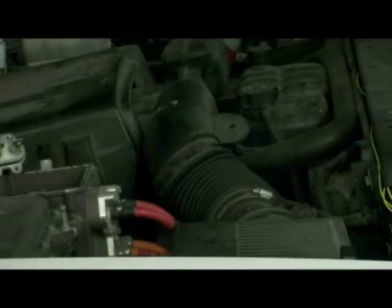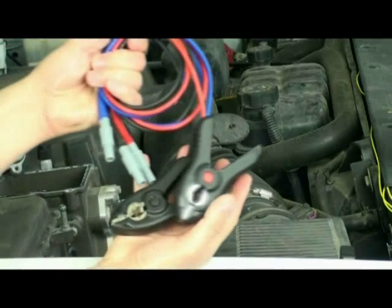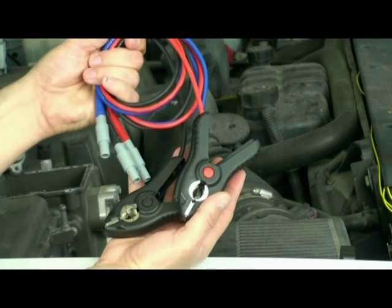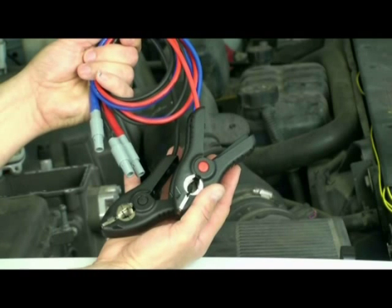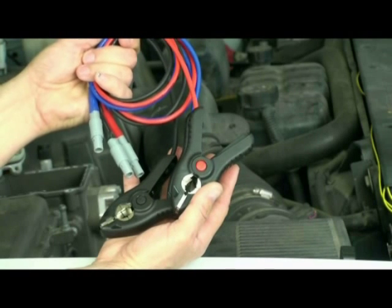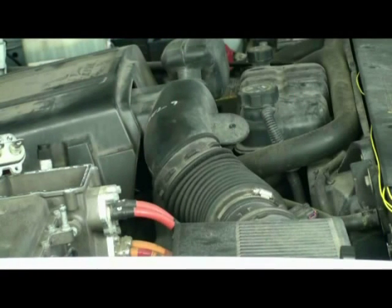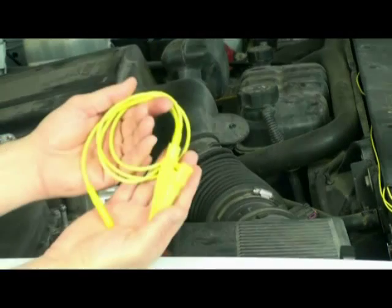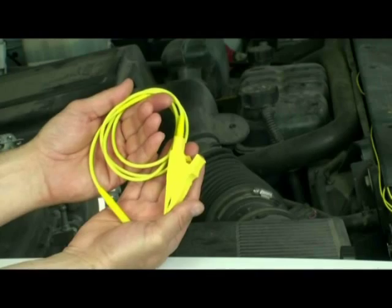As part of the accessory package, there are three leads that will be connected to the rear of your AT33EV instrument. These test leads are color coded blue, black, and red. They will be connected to the three phases of the motor and generator to analyze and test them. The next accessory in the storage case is a yellow lead with a yellow clip, which will be used to perform insulation testing on the windings of the motor and generator.